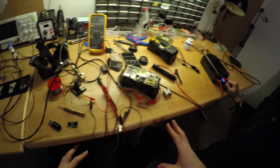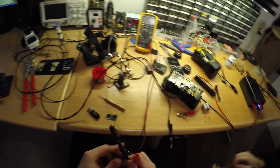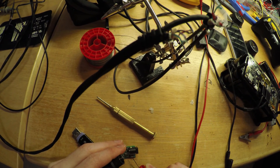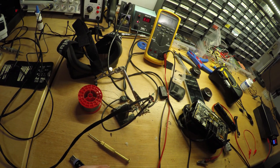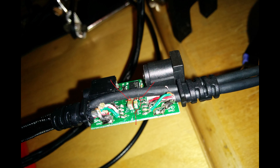When I manually fed in 5 volts and ground from my current-limiting power supply into the correct pins, I got an over-current condition every single time. A quick continuity test confirmed what I already suspected: the ground and the 5 volt pins are shorted. That's usually bad news. It could have taken hours or even weeks to figure out which part exactly was causing the short. But against all likelihood, I just tried to desolder C2, which is probably a ceramic capacitor, and it turned out to be the culprit — bingo. So that's the first time in my entire electronics career that I've encountered a shorted ceramic capacitor.